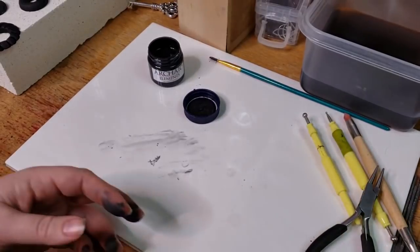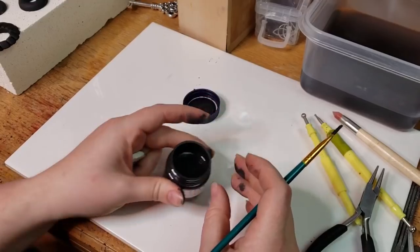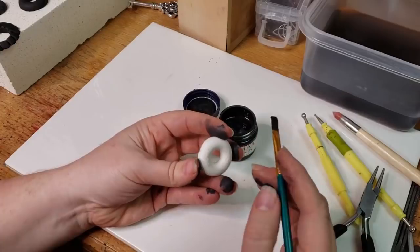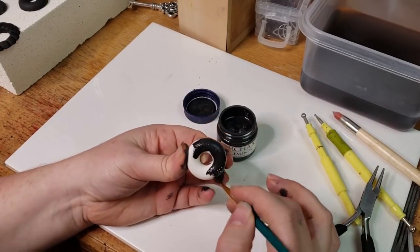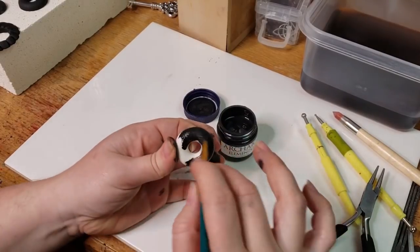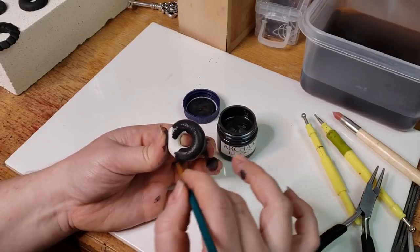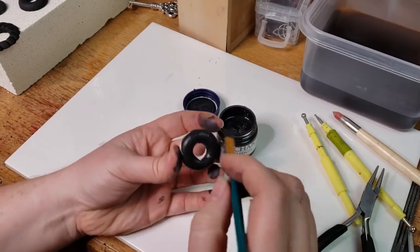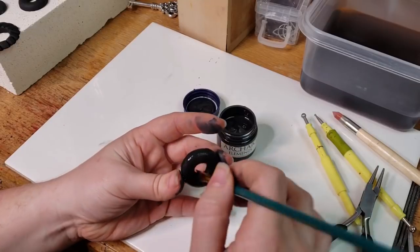So that being said, we're going to go through — and here I have just some graphite paint. It's a conductive paint, and you can see I've got it all over my fingers. I'm going to do a quite generous layer. It sticks really, really well to the polymer clay, so really only two coats are needed, if that. I'd rather be more generous with it than too stingy and end up having problems during the electroforming process.